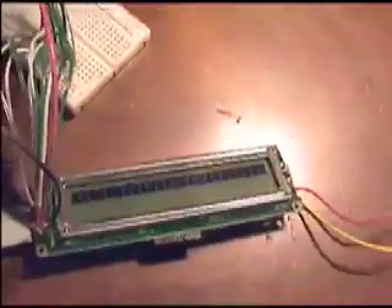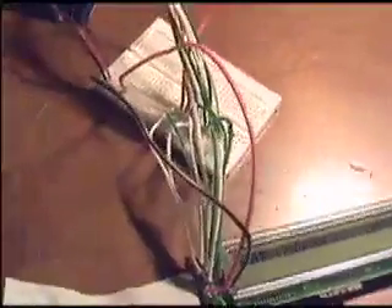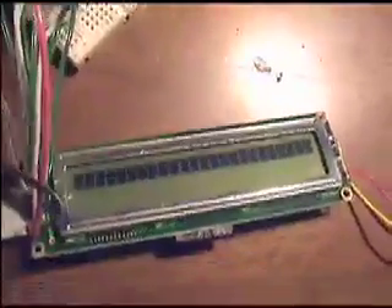I've got my Arduino board running here into a breadboard. Right now I'm running in 8-bit mode, but apparently it can run in 4-bit mode with significantly fewer wires. There are 8 data bit wires, a register select, a read/write selector, and an enable bit — and of course power. When you boot up, the LCD screen shows that default display.